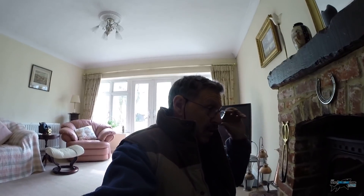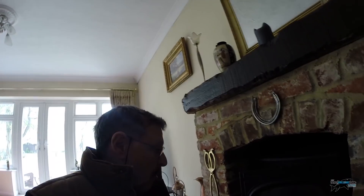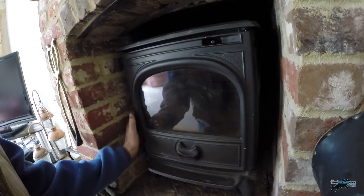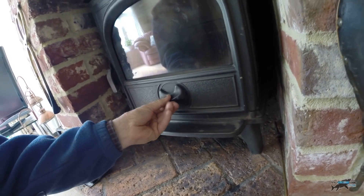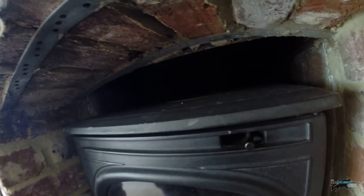Part of the fun of having a log burner. Now something you must do — which I very nearly forgot — close the door, because I'm going to be ramming that brush down the chimney pipe. Make sure that's locked. Make sure this vent here is closed. You want everything sealed up, so any dust or soot that comes down just collects in the bottom, not in the house. Back there is the pipe — a stainless liner that goes all the way up.